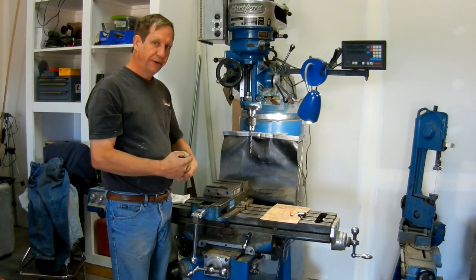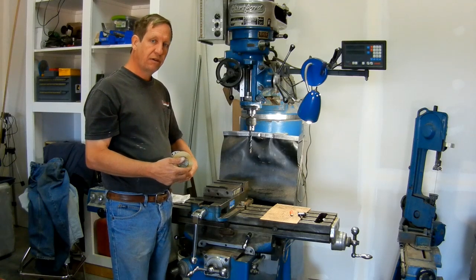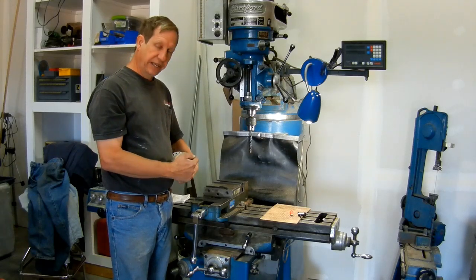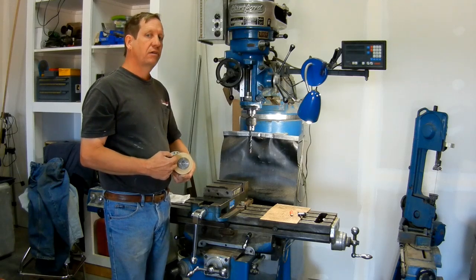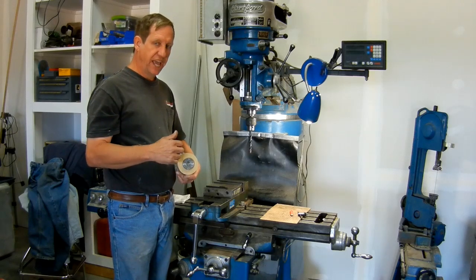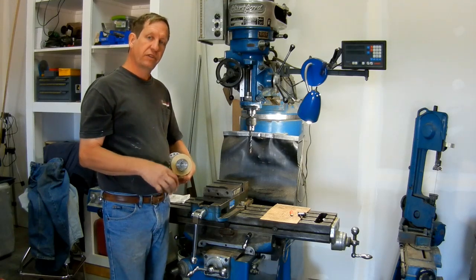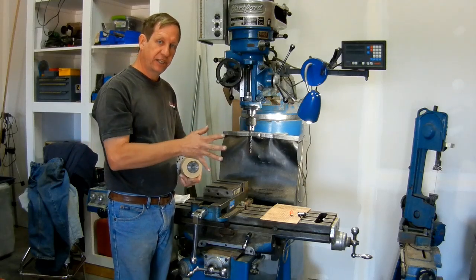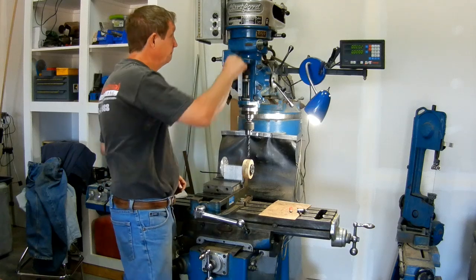This wheel diameter is 3.725, 3 inches, 725 thousandths. And if you do the math, 13 pins will be 900 thousandths apart, which will work perfectly to engage into the 1 inch centers we put on the drum with the 5/8 holes. And it'll give it some clearance so that the pins can make it up inside the drum. Let's make some holes.